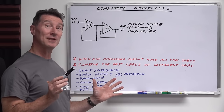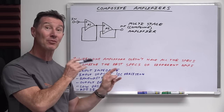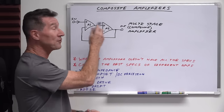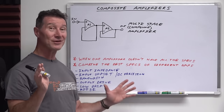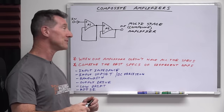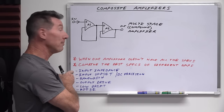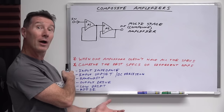Why would you do that in this particular case? Well, at the end of this video, hang around — we'll do a practical breadboard example of kind of what we're looking at here. In the real world, in practical applications, you often have multiple system design requirements for your amplifier, and some of them can include input impedance. You might need really high input impedance. You might need ultra-low input offset voltage, really DC precision stuff.